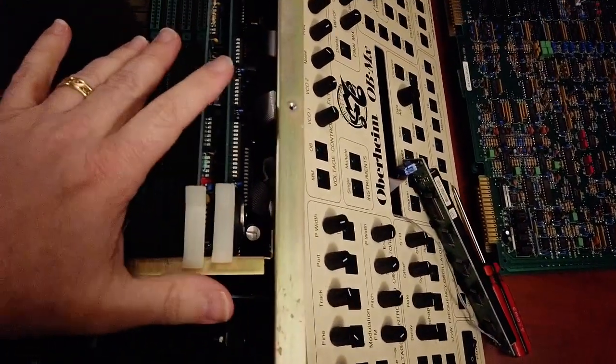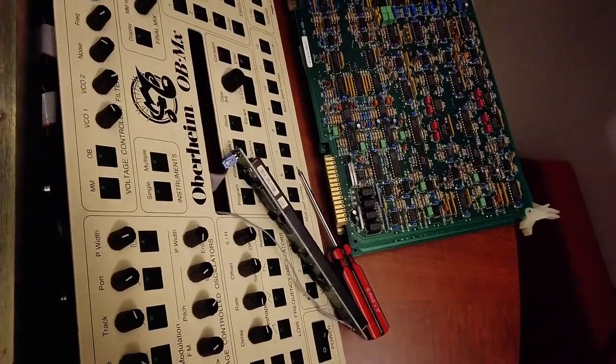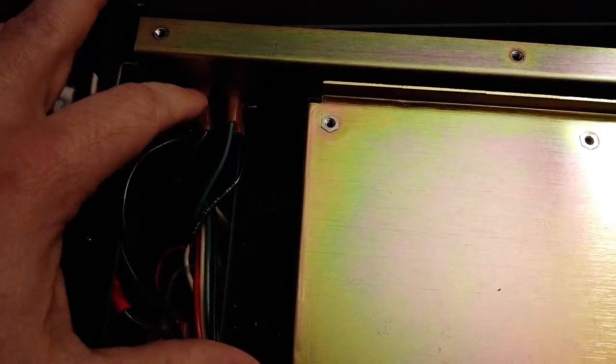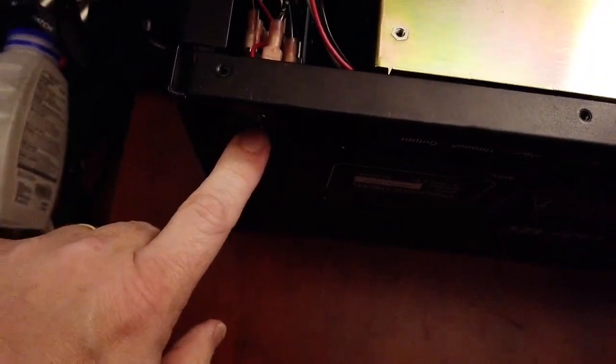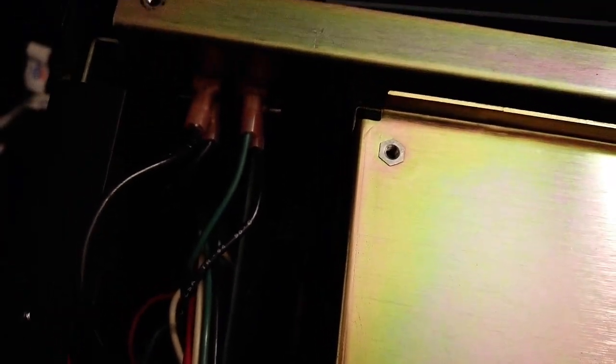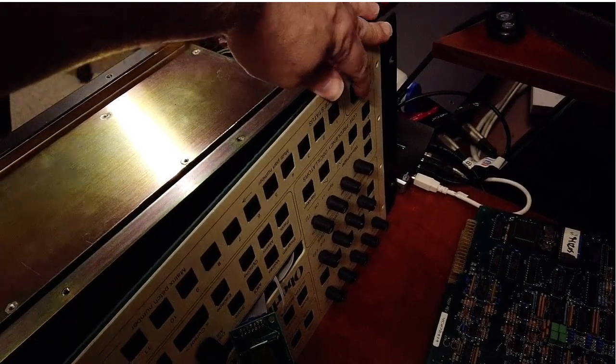I have my LCD dangling here. I've got the master board hooked up with just one voice board - other voice boards are over here. I'm not going to bother with the headphone jack. I need to get the power hooked up without having to reinstall the whole power supply, since I'll need it uninstalled to get everything back in assuming this works. I'm going to carefully look around it with a flashlight to make sure no part of the power supply PCB is shorting against the chassis. Moment of truth - smoke test.